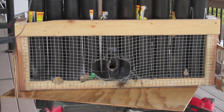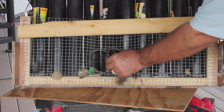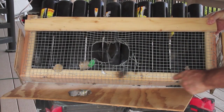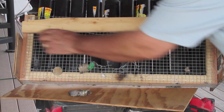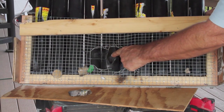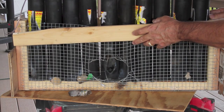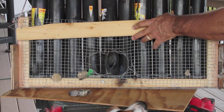Let's get a better look. There's where the tube blew out, and there's actually the shell right there. The wire gave way, but it's completely intact along the bottom. Unlike the chicken wire where the free edge flipped off, this is completely attached all the way around — no staples blew out, just a little bit of wire right here adjacent to the tube blowout. The top rail popped off, but as I said, I'm not too concerned about that. It was just there to keep the tubes in position, not for any structural purpose.